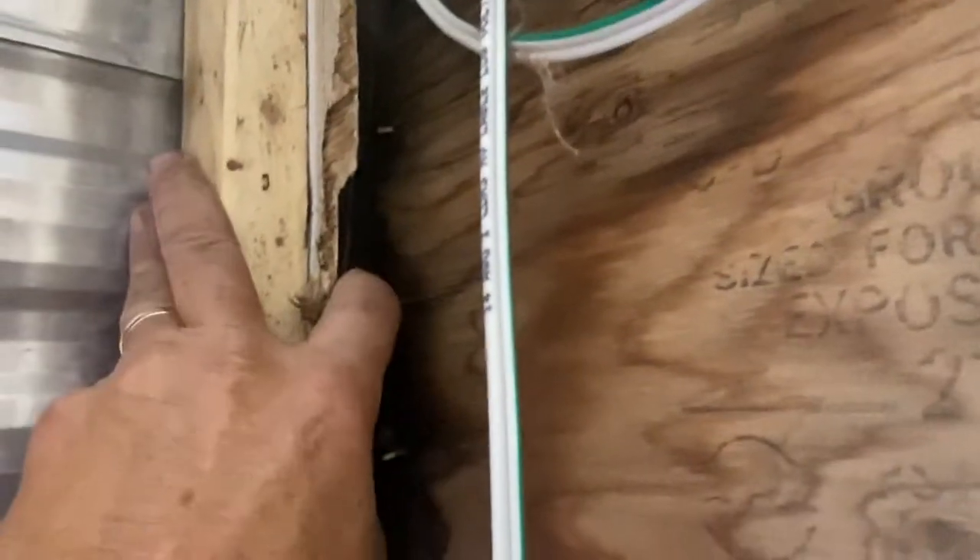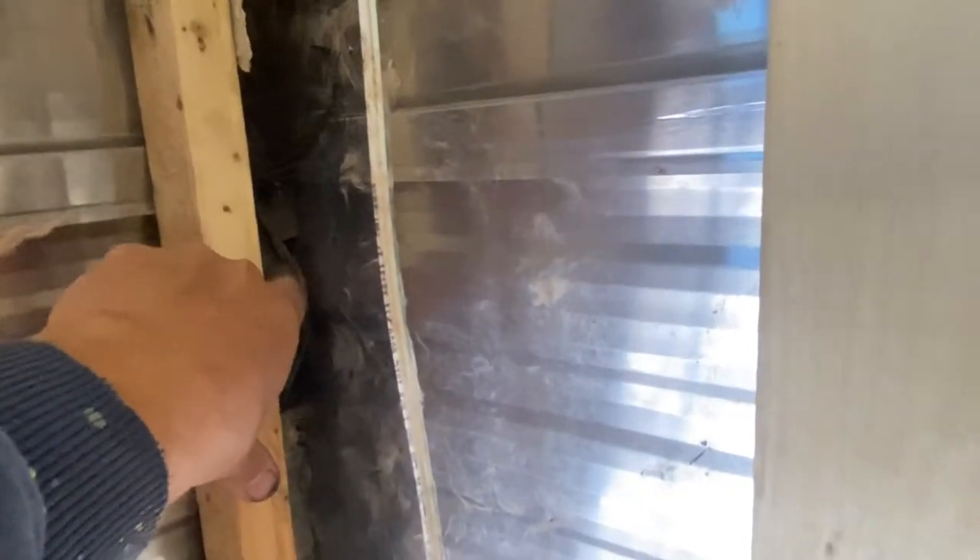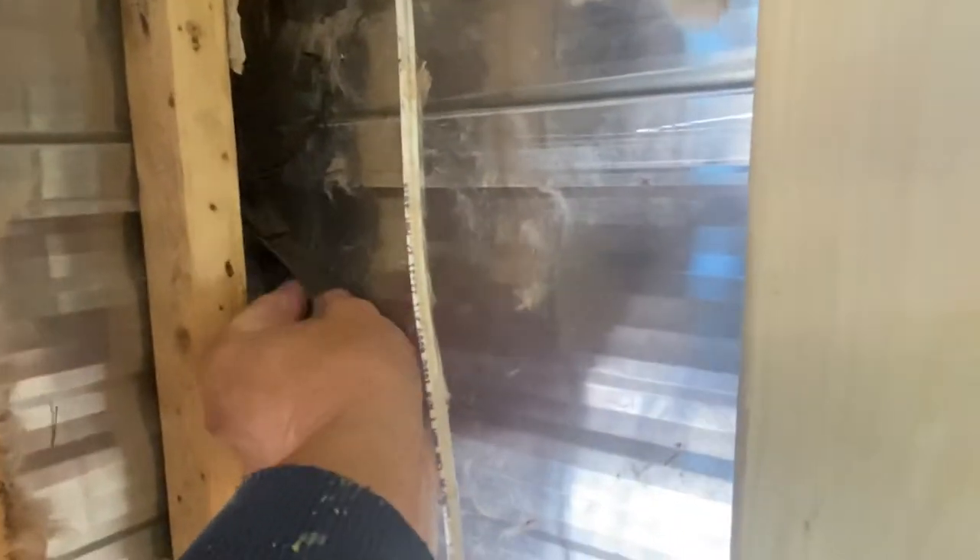The fact that it's solid here is a sign that the water probably wasn't coming from the roof — it was all from the corner. Let's dig this out and replace it. I've already got a board ripped; I'm going to use pressure treated in here just because I've got it. Let's dig in — fun job.